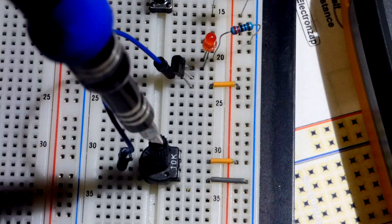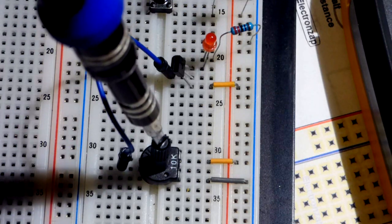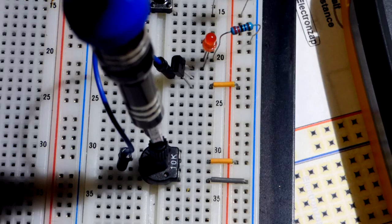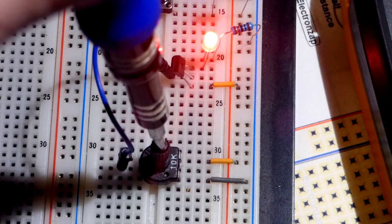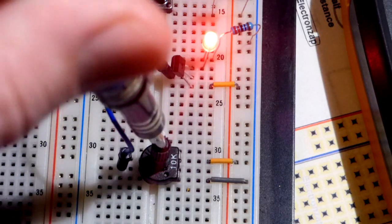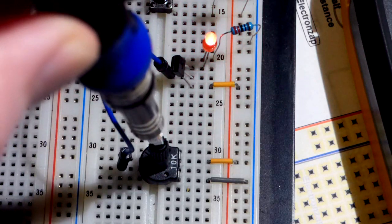The trim pot is about halfway - a little more positive than negative. It's a 5-volt power supply, so we're at about 5 volts now, then 4, 3, 2.5, and so on. Now you can see when we get more negative, the transistor starts conducting, and starts fully conducting pretty quickly. So this makes for a good transistor switch.